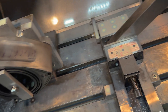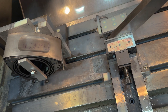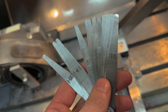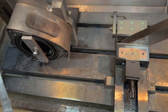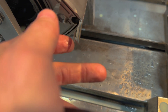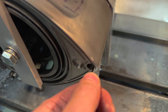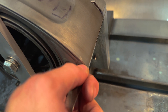Following what Mazda's manual says - apex seal in there and a set of feelers. They say bottom tolerance will be 0.04 something and top tolerance is 0.15. Using a 0.1 feeler - and that is snug. There's a snug fit, so I'm going to say it's mid-limit at the moment. I might be able to true that up a little bit more so it cuts better, and also get the height on the next one dead perfect, because if I get the height dead perfect it might actually cut smaller.